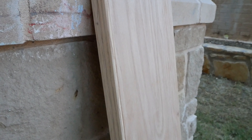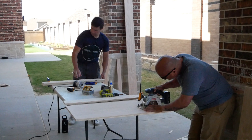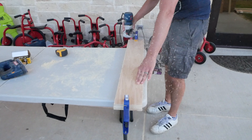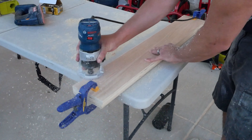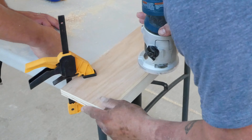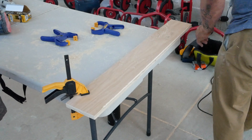Here's the tabletop all sanded and pretty. We probably did put these two pieces together prematurely — you'll see why later — but of course the guys did find a way around this as well. Just shaping the edges like this makes such a difference in the overall look. We rounded off the edges of the legs too. The router is probably the messiest part of this whole project, so just make sure you're in a space that's easy to clean. You may want to put a plastic tarp down and wear something you don't care too much about. David also used the router on the shelf of the table, but he stopped about two inches off the ends so that we could screw that into the table legs.